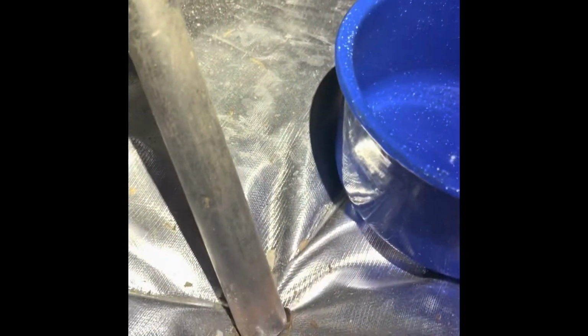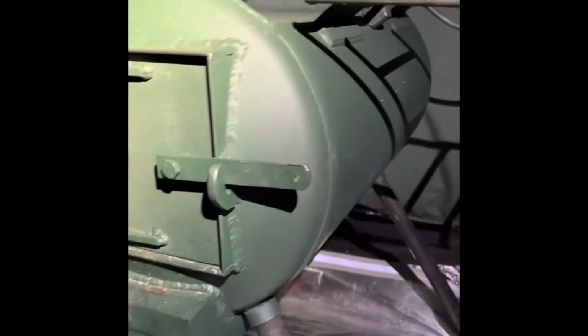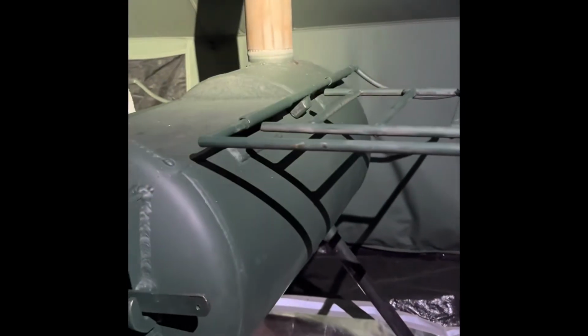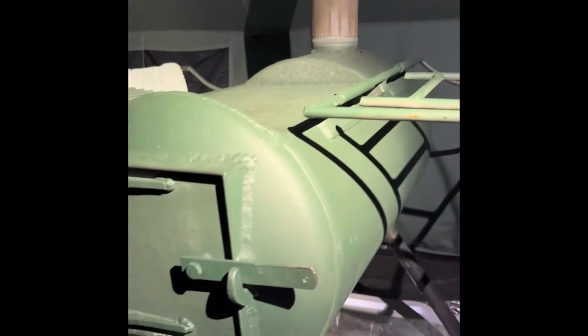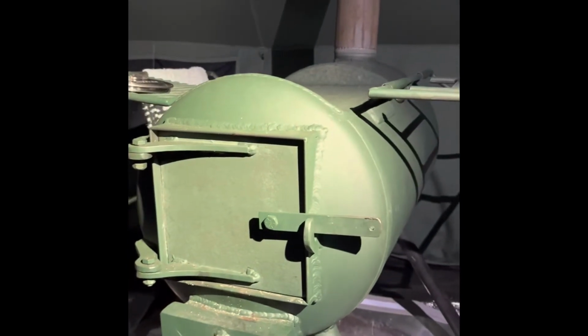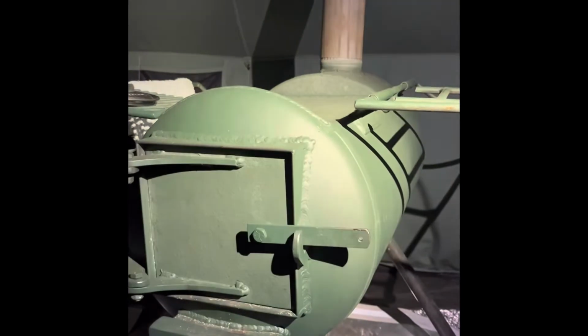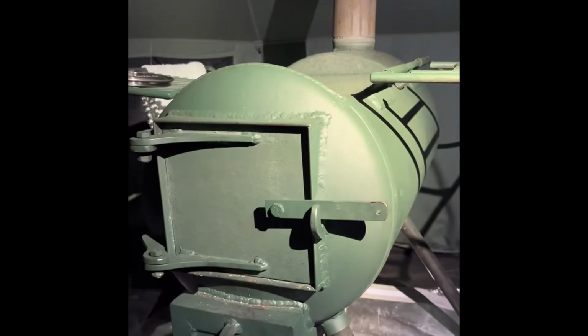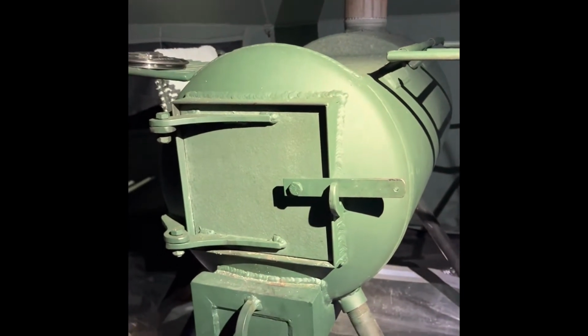The legs are black iron pipe, and I just took a couple of couplings, cut them in half, so I had 4 pieces. They'll screw in and out, and I welded the bottom up so that it's not tearing into this fire mat here. And the legs will fit inside the stove with the chimney pipe sections and everything, and it all packs up. So I like to put it in a piece of canvas tarp, and then just throw it on my hunting cart, my deer cart, and can drag it in the woods, no problem like that.